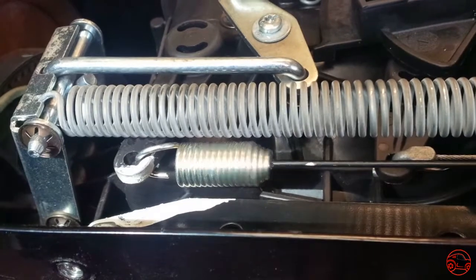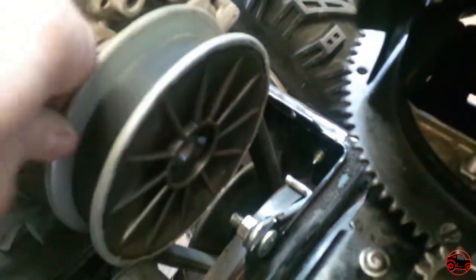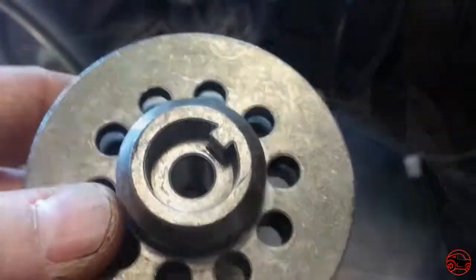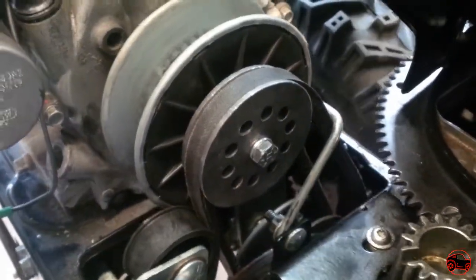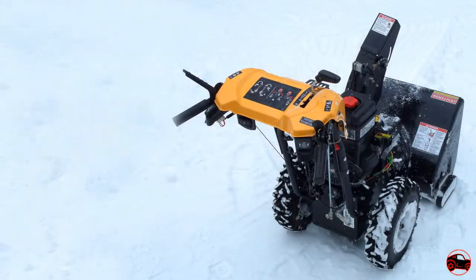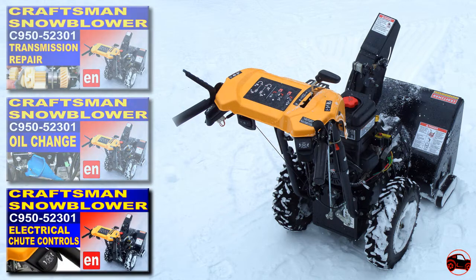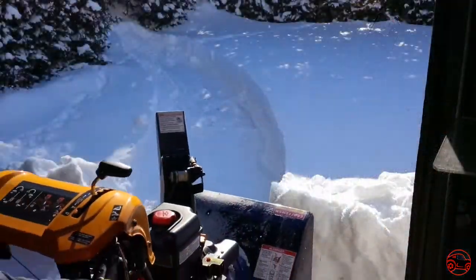After, I made more tests to check the adjustment of the cables before installing the engine. When that was done, I installed the engine in place. The pulleys and the belts were installed and adjusted to be ready for the first engine start. Later I installed the electrical harness and reconnected the plugs, and completed the overall assembly with the remaining parts. In video part 2, I will show you how I changed the oil on my snowblower before starting the engine. In video part 3, I will show you how I fixed the electrical problems with the actuators that control the chute and the deflector. And finally, I will test my snowblower.